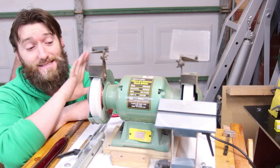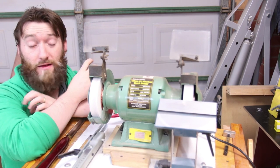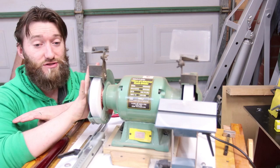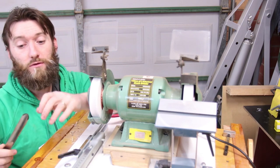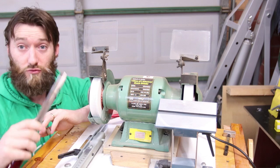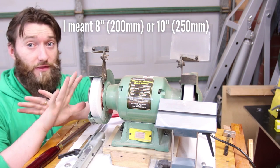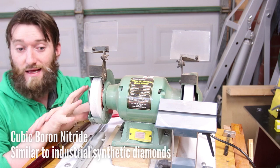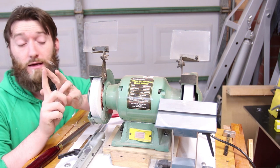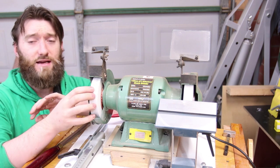This is what I use to sharpen — a 6-inch grinder with aluminium oxide wheels, both 120 grit. It's actually quite a cheap setup and it will get your tools sharp. Ideally you'd have either an 8 or 10-inch wheel, because the curvature of the wheel is reflected in the grinding. The larger the wheel, the smaller the curvature at the point of contact with the tool, so you'll get a flatter grind, which is a good thing. Ideally you'd have either 8 or 10-inch with CBN wheels. These are much more expensive wheels but they've got real added benefits: they run cooler, they run quieter, and they generally will last a lifetime, whereas aluminium oxide wheels are consumable items.